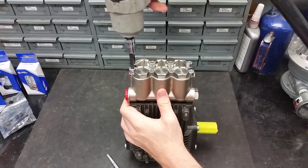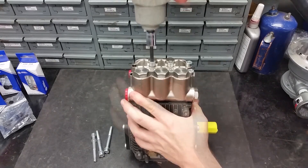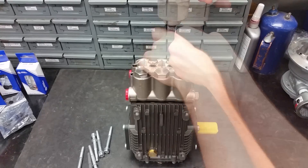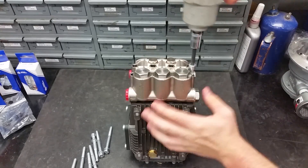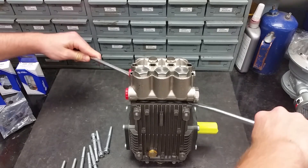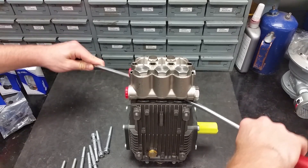To replace the pistons, water seals, and piston guides, you will need to remove eight manifold bolts with a 6-millimeter hex socket. Using two screwdrivers on opposite sides of the pump, hoist the head up so it can be lifted off.